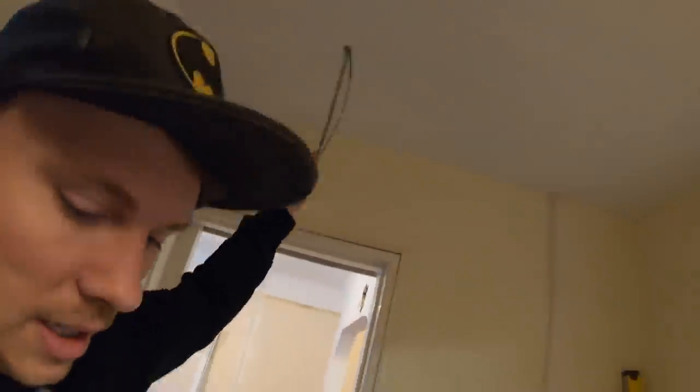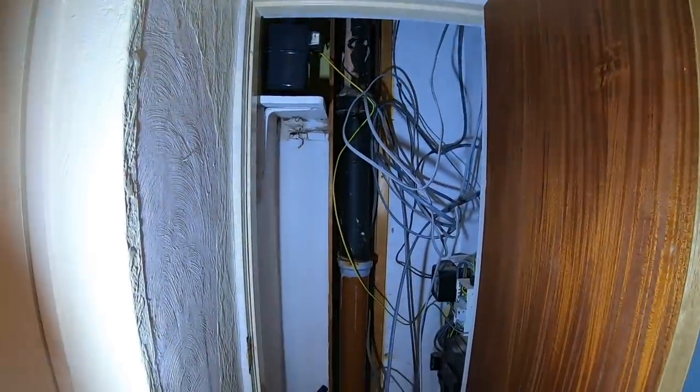While they've been here for about half an hour, I went to the customer — they want mains-powered smoke alarms, which is obviously most of the time a definite. So we've got a heat alarm in the kitchen, a smoke alarm there, and one on the landing. I've just been running that cable, dropping them down. Some torches — just literally poked a hole and dropped them down. We've got three socket circuits, a cooker circuit, and a lighting circuit. We need to run one more up for the boiler, which will just go straight along the soil stack.